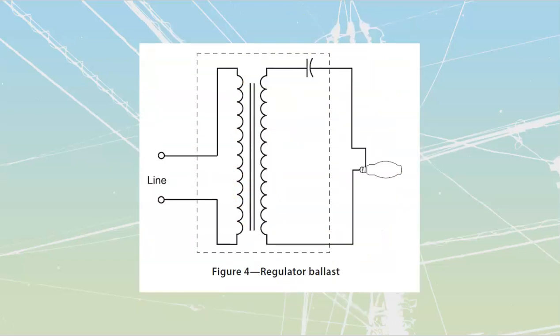This one, we are now going to be dealing with two separate windings, which means that those two separate windings are going to be, as we talked about numerous times inside of transformers, acting as if they were individual inductors. Yes, they're bound together by mutual induction. They have to be, but they are going to act as inductors, which means they're going to oppose dirty voltage spikes that are coming through and stuff like that.